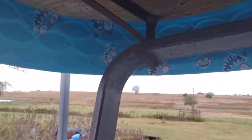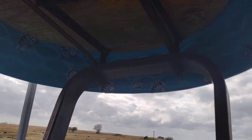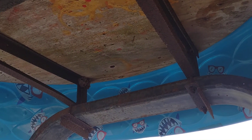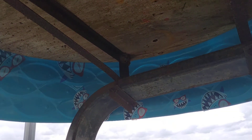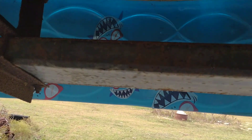The other thing I wanted to show is my kiddie pool toppers. What I did was use some real light-grade angle iron — not even an eighth inch thick, about one-by-one — welded together into a simple little frame. It's not welded or anything to the ROPS; it simply bolts to the ROPS so that you're not messing up the structural integrity of the ROPS.